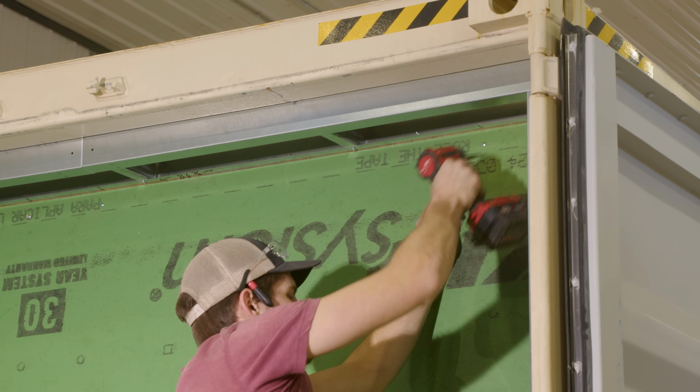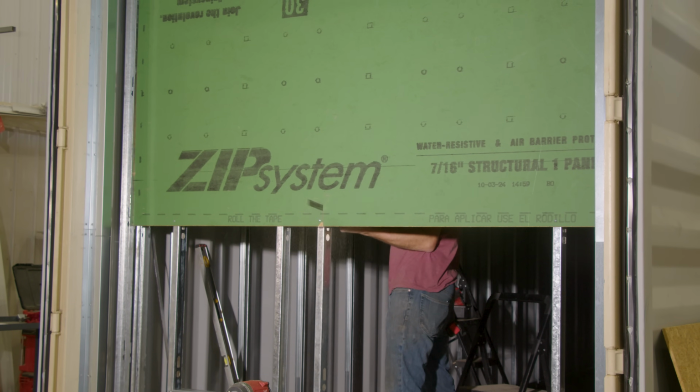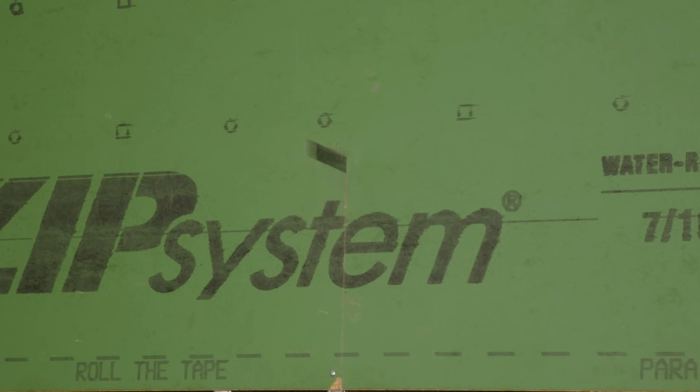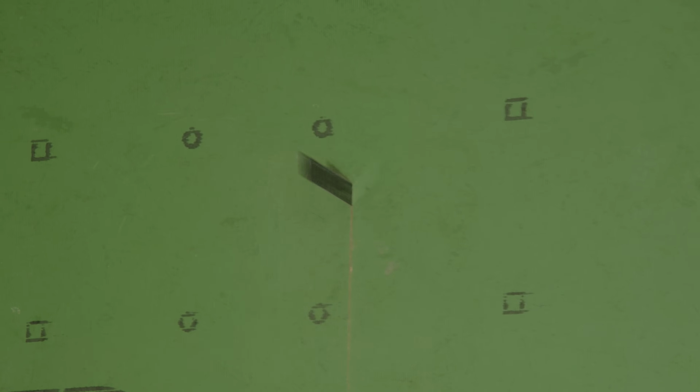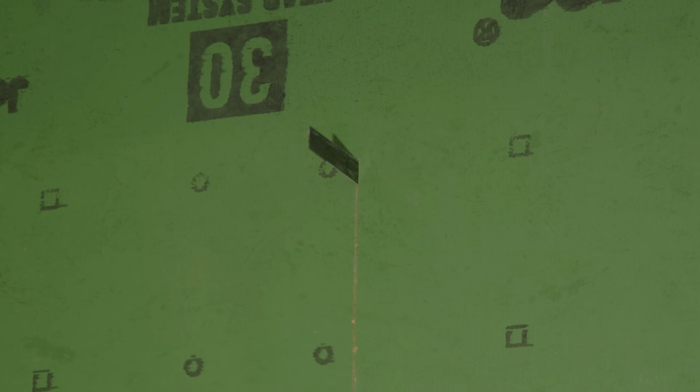Here, Wild Bill Will's using a Sawzall. We should be using our router here. And I also noticed that he doesn't have a lot of screws in the studs, so it's shaking. You'll notice afterwards that all the screws are there. You should have done that first, and that's really going to help you router out all your windows. But that's a great way of sheeting. I think that's pretty common knowledge, you just sheet right over top of your windows and doors and just cut them out afterwards.